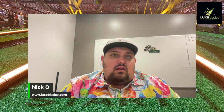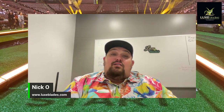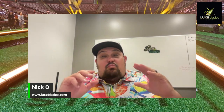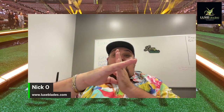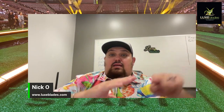One thing I will tell you, as you do fields, especially soccer fields, a lot of uneducated people in the sports fields just do landscape turf, they'll put in a minimum of infill and they'll say see you later. But what happens, I don't know how many times I've been called to come fix people's mistakes. What happens is people don't put enough infill in. So if your fibers are all laying this direction and you kick a soccer ball straight, it's going to go that direction, the same as the blades.